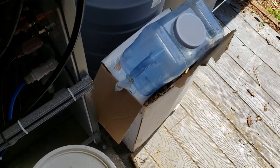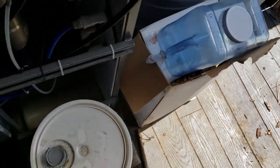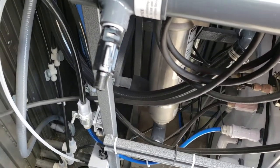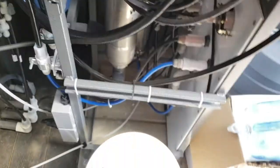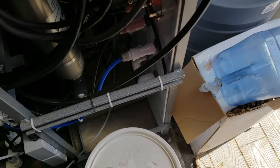If you are getting solution being dispensed at this point, then the next thing to do is to take apart this injector. This is where you will want to turn the water off and use some sort of a wrench to take this apart.